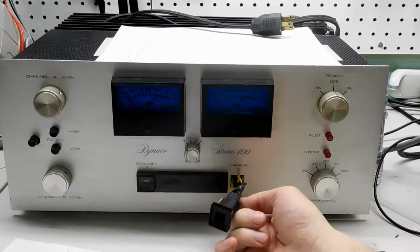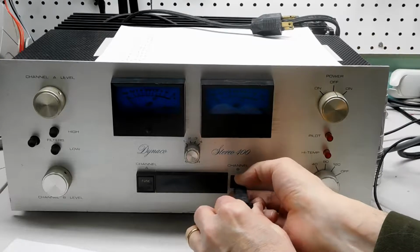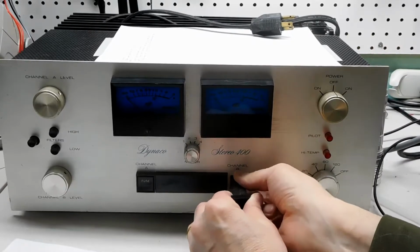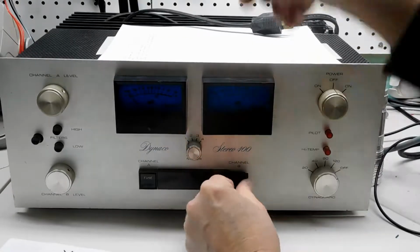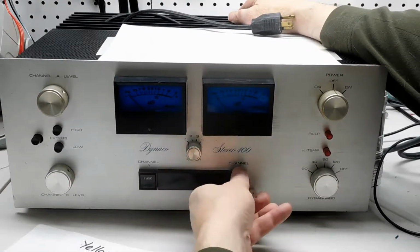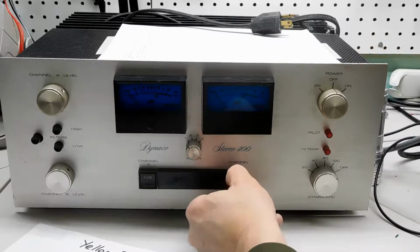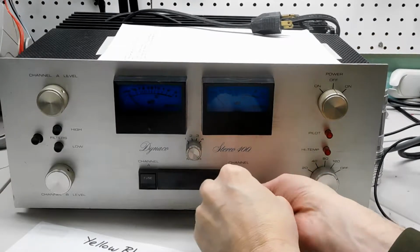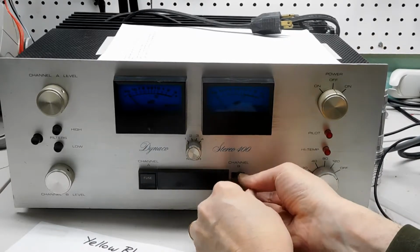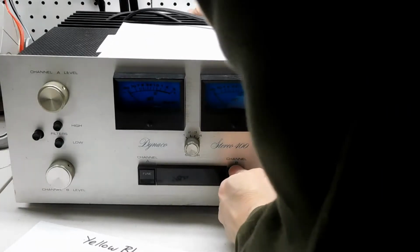We've now moved the fast-ons to the new fuse holder, and we just have to compress it a little bit to get it through the hole, making sure that top says top. Oh boy. And of course, as Murphy's Law would have it, doesn't seem like it's going to want to fit. It's probably because the wires in the back are getting in the way of something. So what we're going to have to do is open things up so that we can pull and dress the leads out of the way. Give it one more shot. And it's not going to go.